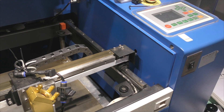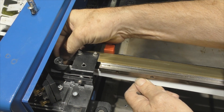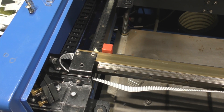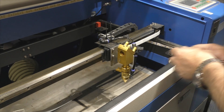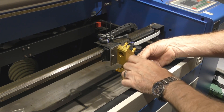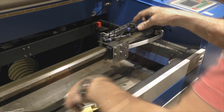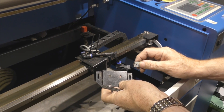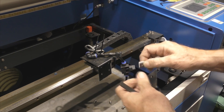Let's go and see how we're going to fit them onto the China Blue machine. First thing we're going to do is go through the electrical control cabinet and slacken off the timing belt. It's a very weird tensioning system but it seems to work. There's just enough slack to take that off without disassembling the belt — although actually I'm an idiot, the timing belt has got to come off anyway. To do that I shall have to remove the head as well, but we know it's no big deal to set the head up, so we're not in the least bit worried.